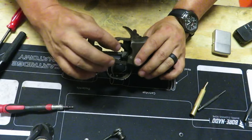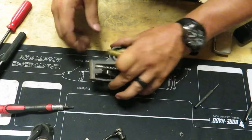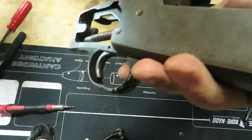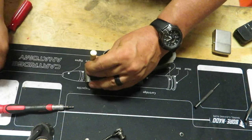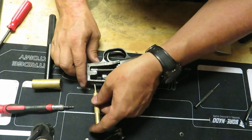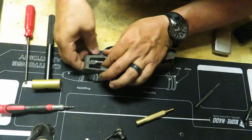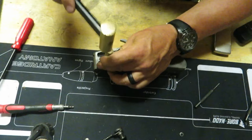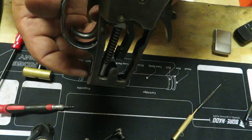Make sure that your connector piece is not impeded. Take a punch and lightly push this down. This hole right here is where this is supposed to sit — you can see it on the back side. Let me bring my light in — you can see that hole, that's the hole we're trying to set it into. Take a punch and very gently punch it to where it falls into place. Once it falls into place, you'll know it because it ain't coming out. I don't have a press but it's done the way I can do it.